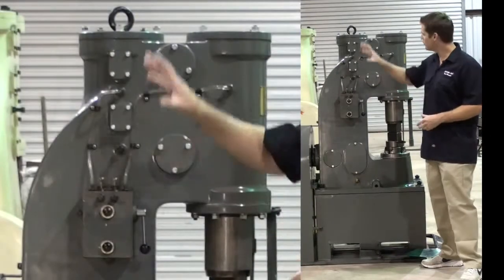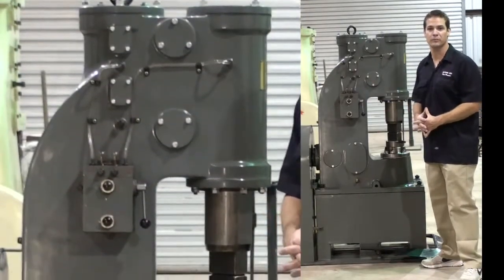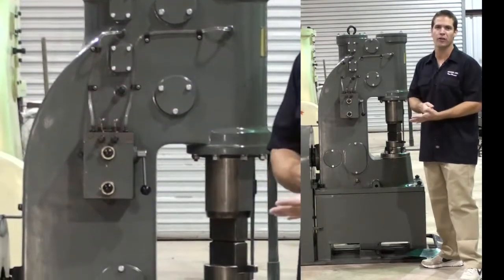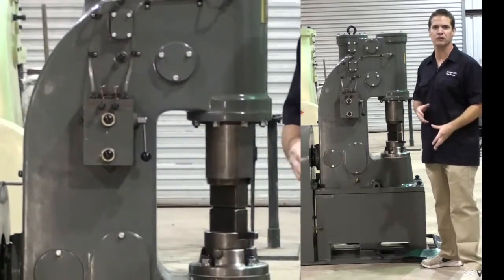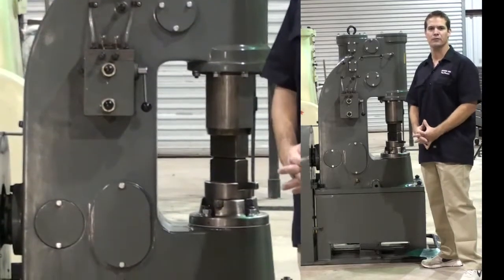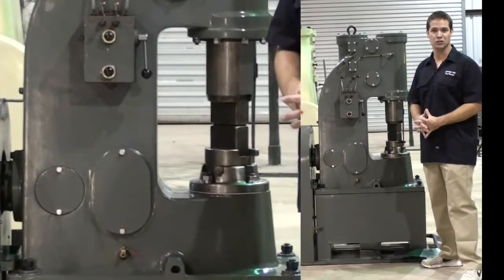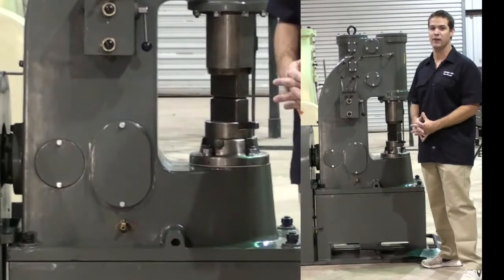In the back of the hammer is a cycling piston that generates an air source that is always present. With this design, you can run multiple parts one after another without any power loss or having to wait for a separate air compressor tank to fill up. These hammers can be run full throttle, three shifts a day without any compromise of the hammer's performance, which is exactly why large production shops and factories still prefer the self-contained design.